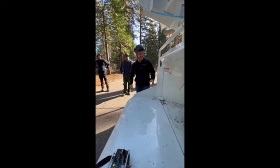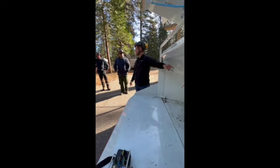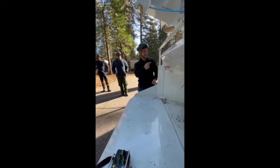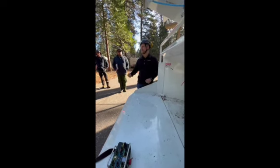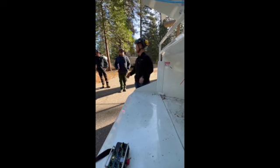Again, guys, when you're done doing that adjustment, 180 foot-pounds. That's the magic number on this machine. Make sure those are torqued, just like the knives, exactly to that spec. If that anvil moves over while you're chipping, you guys finish the story. Machine's grenading.